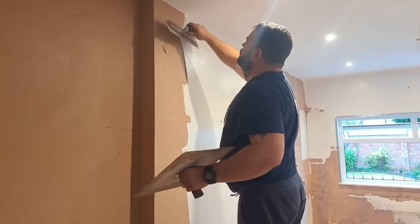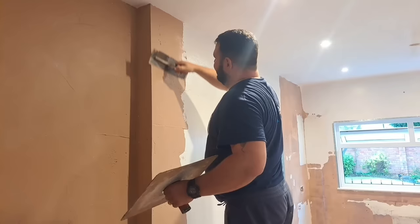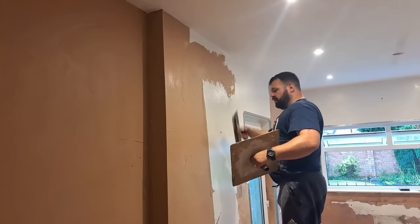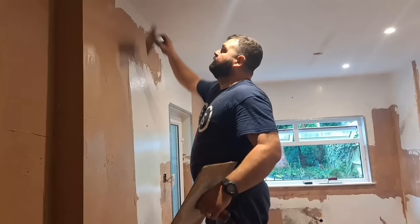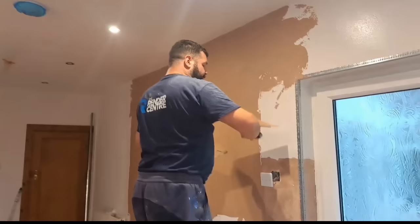Fill these beads out as you're going - always up and down your beads, never out across them. Don't curl them out like some say. As for starting points on walls, some fellas like to put just a band across the top and work up to it, some fellas come so far down and do the middles. Ultimately I'll just do a band across the top and then bring the bottom up, just to limit the amount of times I'm going back and forth across a wall.